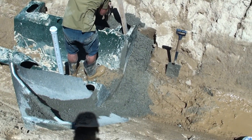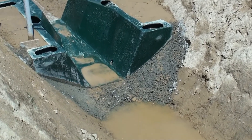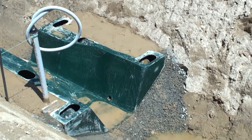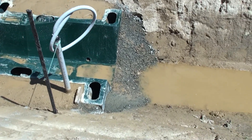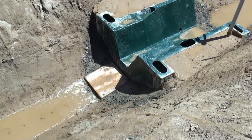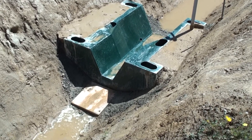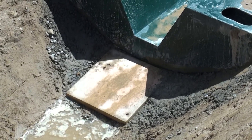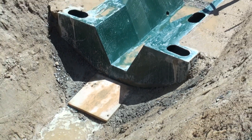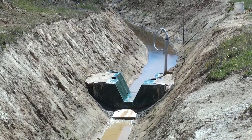Just making sure the concrete is right around these two wing walls at each end. You can see we've formed a ramp and a wedge up the side there just to help with the water flows. We've set the whole flume about 100 millimetres higher than the race floor to get a little more fall off the back end, as the race is very flat here. We've ended up with about 100mm rise at the front headwater end and 200 millimetres at the tail end, falling onto a paving stone to help dissipate energy before it goes back into the race.